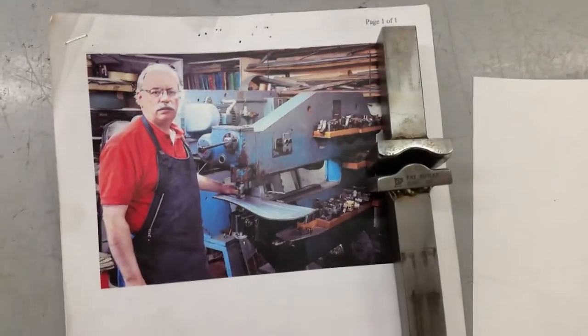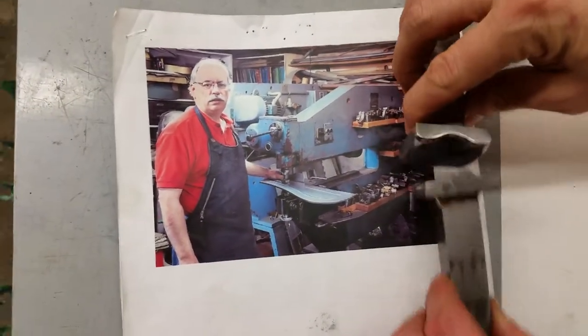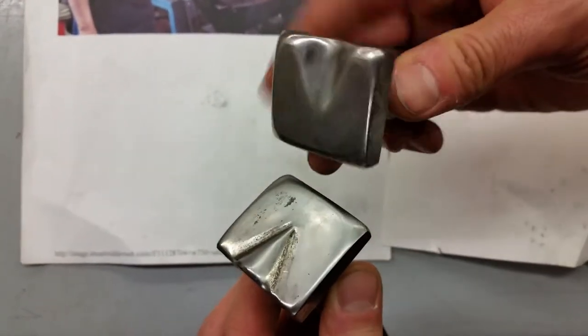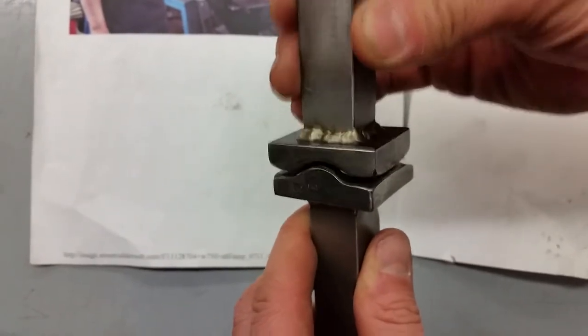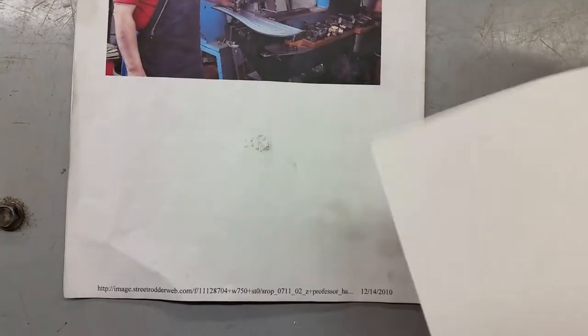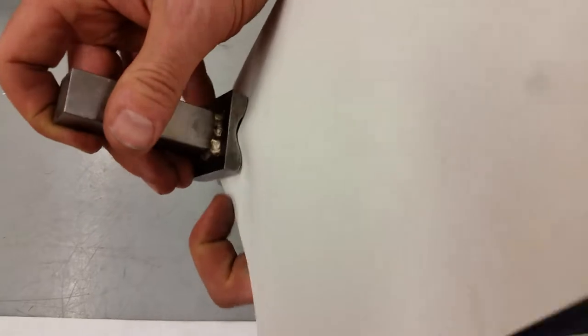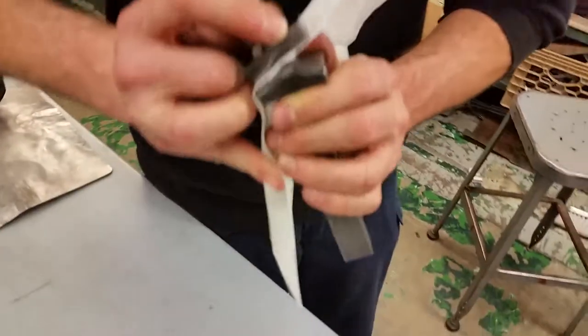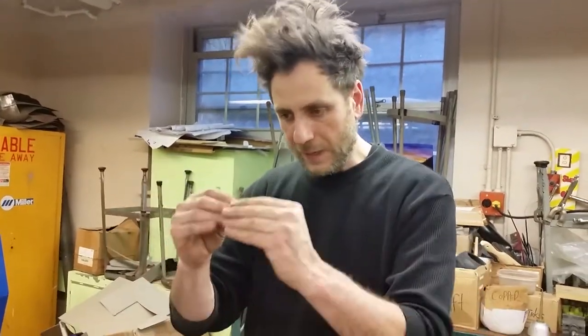That's Mr. Faye Butler. He is well known in the metal shaping industry. What he made for us is basically a tuck tool — a thumbnail piece and a receiving piece — and when these go together they hammer like this. The sheet would be fed into the machine and it would create a tuck. When you pull it out, it pushes it all back together, making it thicker and shorter — a shrunken piece.